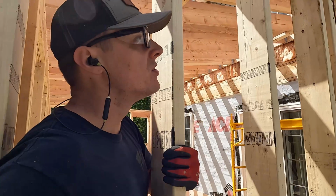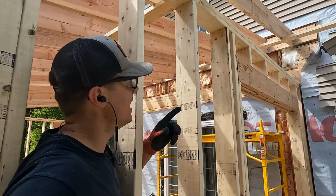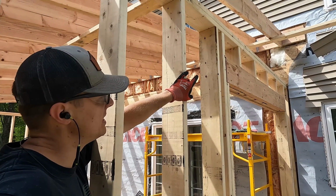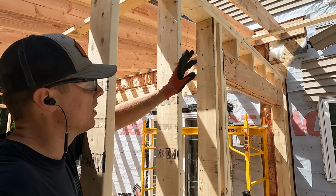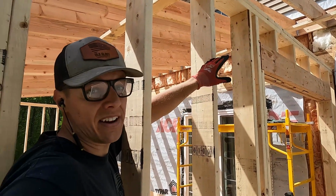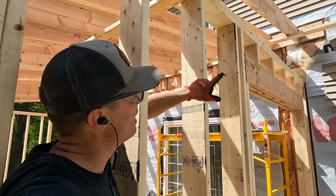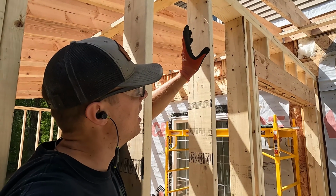All right, you guys, so what I'm gonna do now is the fly rafters. I went up there to our ledger board and I measured. It's gonna be 10.5 in between our joists there. So our last joist will land on the end, 10.5 in the middle. I have these 2 boards here screwed to the other rafters, and that's gonna help hold it there while I secure it to this last rafter.